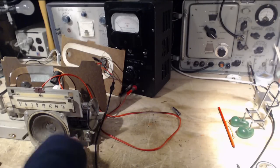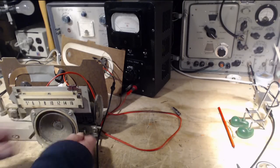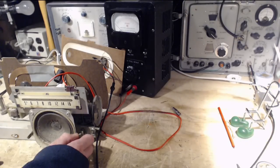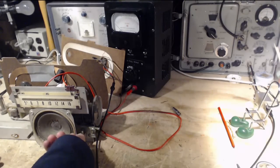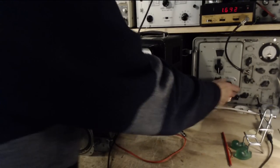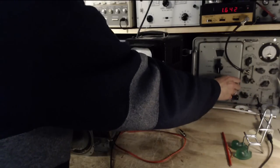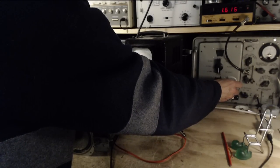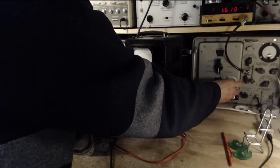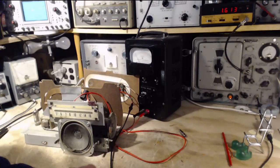It did say minimum, didn't it? Yeah, up at the top of the dial, of course. Open capacitor all the way. That looks almost like 17, but we'll go with what it says. I'm checking the capacitor, make sure it is. Yep, capacitor's completely open. 1650, eh? 1650. So the signal coming out of the signal generator now is reaching this coil. Lots of power. It's way off. 610. It should say 1650. So we need to adjust the oscillator.